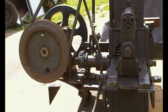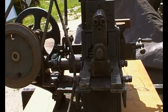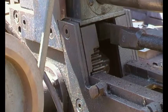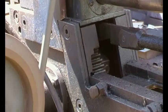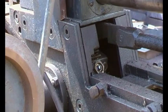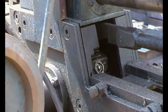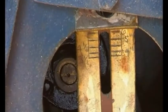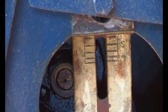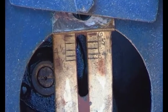So that is the primary drive there, which goes through to the back of the shaper. And that primary drive drives this gear. And as we turn it round there's an adjustment there, and that will be for the stroke. If we look at the other side, there's some handwriting and some marks for adjusting the stroke of the crank — which of course adjusts the stroke of the cutter.